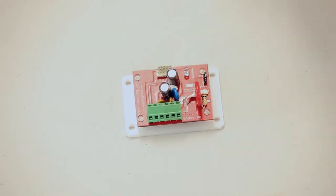Okay, so this is the board. It has 6 terminals on it that you wire in and a connector that the AccessPack goes onto. The first 2 terminals are shorted together to tell the AccessPack that the equipment has been stopped. The second 2 terminals across are active and neutral, and you wire AC power into those. 240 volt max, guys, so if this is a 415 or a 440 install, then make sure you find the neutral and you've only fed that with 240 volts.